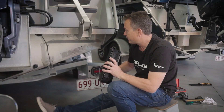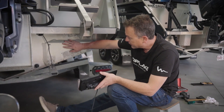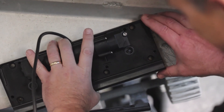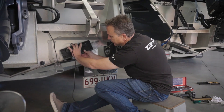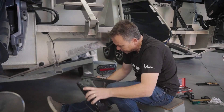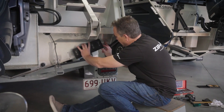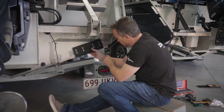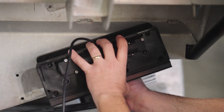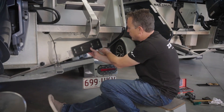We've removed the trim tab system off the back of the boat and now we're looking at how we're going to place these interceptors on the transom. These particular holes have a plate welded on and we've got a bit of an issue with height. To get all six screws in, we'd end up having the Zipwake Interceptor too far inboard when we want it further out for maximum roll leverage. So we're going to use these adapter plates, designed for a different purpose, which will allow us to mount the adapter plate further out, get eight screws into this plate without any cutting or welding, and then fit the Zipwake Interceptor to the adapter plate out where we want it for maximum roll leverage.